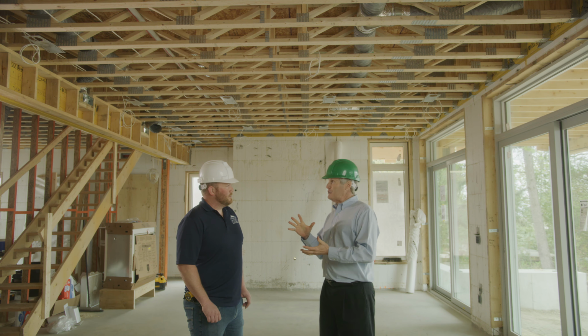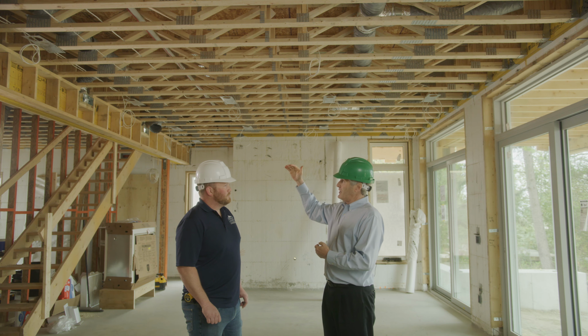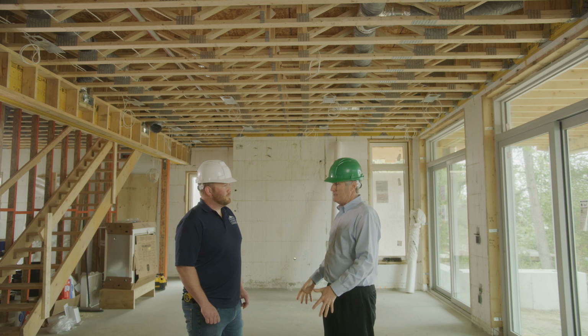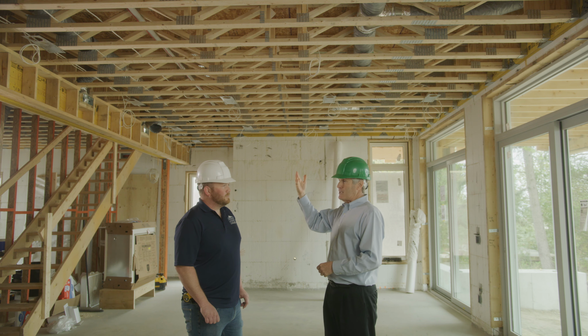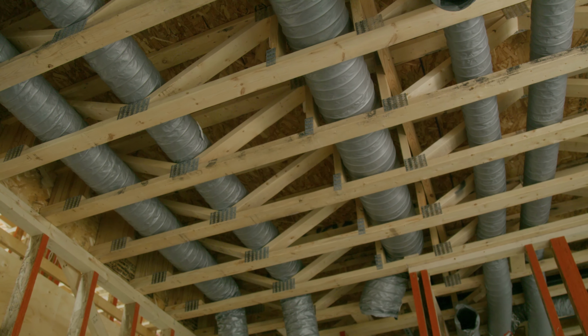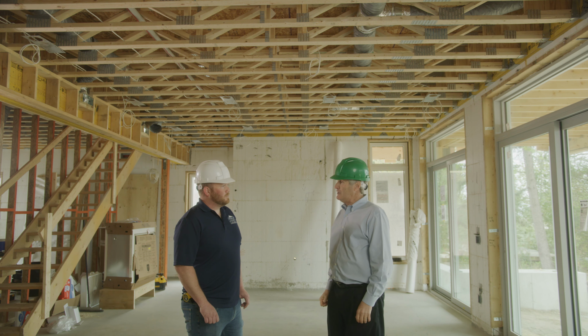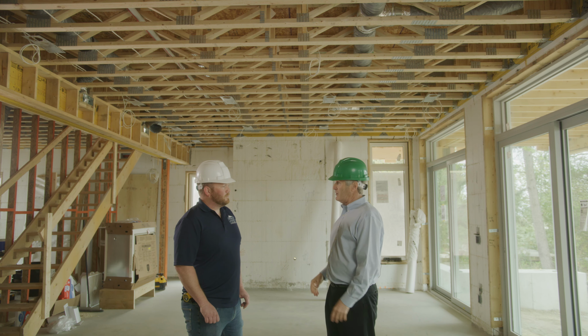And then you'll notice as well that on the main floor, we did a high wall. That is, we're moving the air across the ceiling because mainly the air handler here is for air conditioning. We're doing in-floor heating, so that's our primary heating. On the second floor, we're taking that airflow up and throwing it up, and we'll put in commercial grade grills that'll throw that air. So all of the ductwork for these 2 stories is buried in the first to second floor ceiling assembly. We didn't need to worry about penetrating attics, and we didn't need to worry about building bulkheads on the main floor. Worked out pretty well, don't you think?